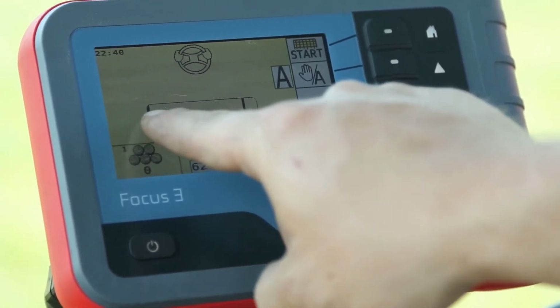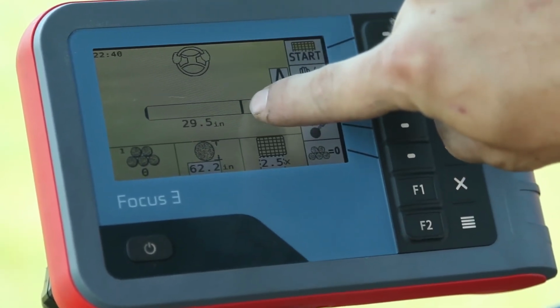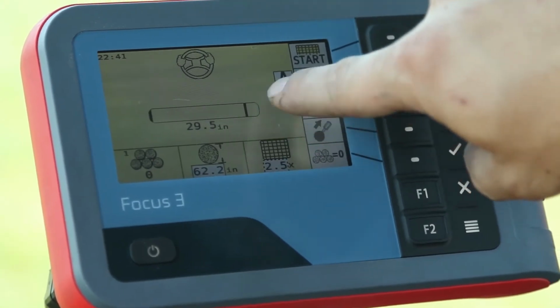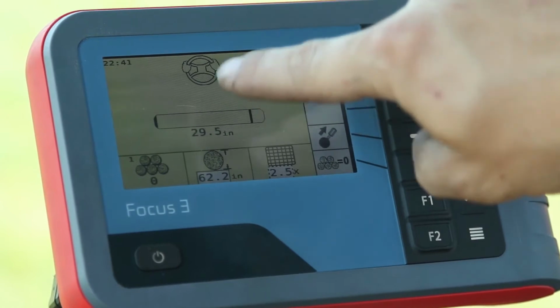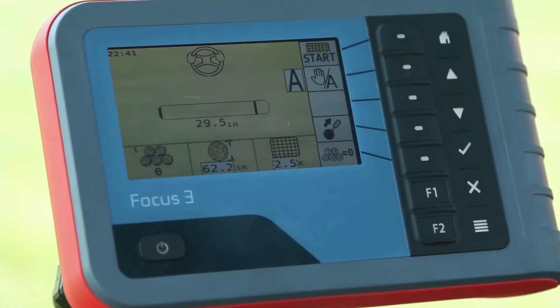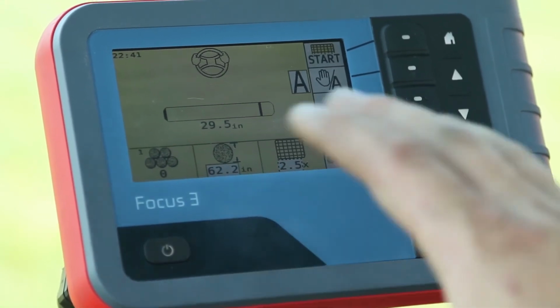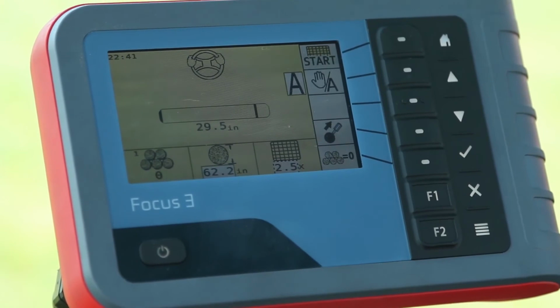As this bar fills black, our bale is getting larger. As it hits this black line, a warning beep will go on that we are at 90% completion. Upon 100% completion, the monitor will beep for a long period of time and flash a stop sign. At that time, the operator will stop the tractor. The baler will automatically start wrapping. As the baler's wrapping, an icon will pop up that counts the number of wraps that is being put on the bale at the current time.